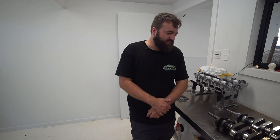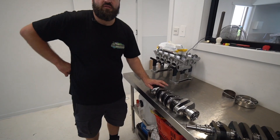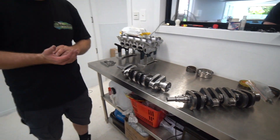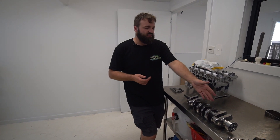Spinning a crankshaft through vacuum is also a thing. I didn't realize the polishing was done for the actual bearing surface and not the crank exterior. It's done for the bearing surface. As far as polishing goes for clearances, it would make a difference of maybe tenths of a thou — it's at a microscopic level. Your surface finish on the crankshaft has to be good enough already. If you took it straight off a crankshaft grinder and isopolished it without linishing first, you'd still have ridges and dips. You have to linish the shaft after a crankshaft grind and then polish it.